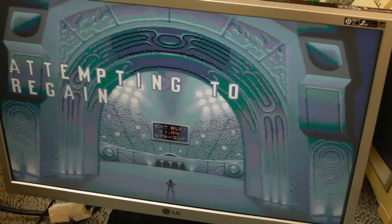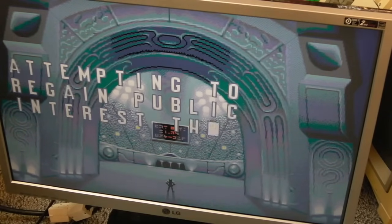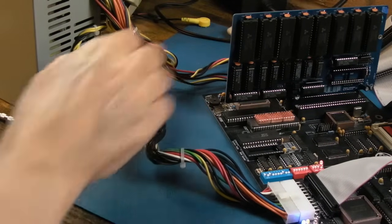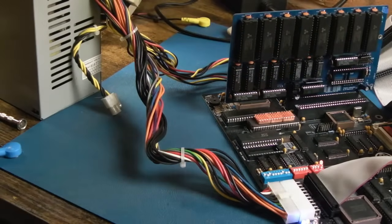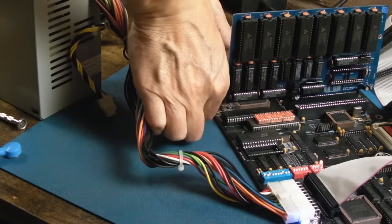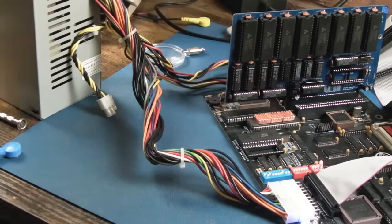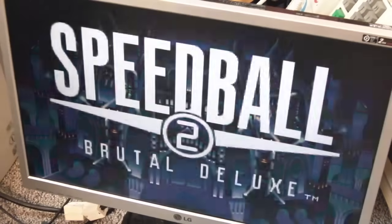So, testing a few games that do work on here. Obviously it's the Amiga game, this, and I was going to try and get the speaker working, add a speaker, and then realised the board's already got one. So inspecting down here it says jumper 1 to 2 for onboard speaker. If I can just work out where 1 to 2 actually is, well, 1 is this one down here, so I've got a jumper. Let's do it while it's on. There we go. Hey! Sounds terrible. Yeah, so, speaker rendition of that music.